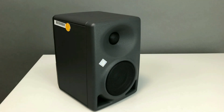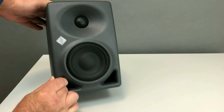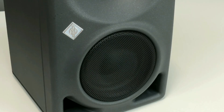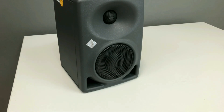The two-color Neumann logo displays operation status and activation of the extensive protection system. The in-house modeled long-throw composite sandwich cone driver features an extremely linear force factor and flow-optimized die-cast basket. Damping of break-up modes brings low distortion at high sound levels. Linear pistonic motor gives very low harmonic distortion even at high excursions. Reduced air noise and improved rocking modes. Robust metal grilles protect against mechanical damage.